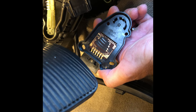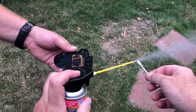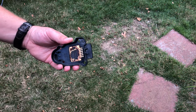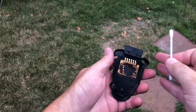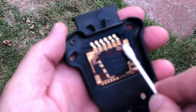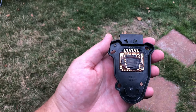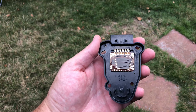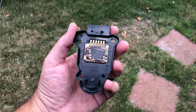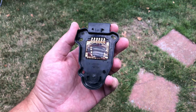We may pull some of these teeth up here back toward us to increase their contact with the board, then reassemble. With our DeOxit we're going to lightly spray a cotton ball, maybe a shot there, and then delicately scrub those contacts. We'll let that dry — the can says overnight, but two minutes is fine. We'll do a shot on the combs inside the sensor, maybe pull those forward a little bit, then put this thing back together.